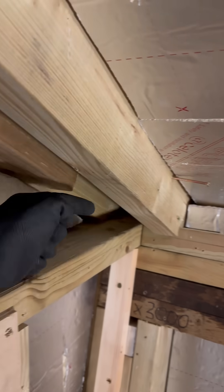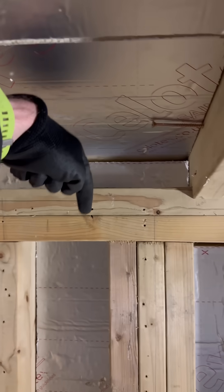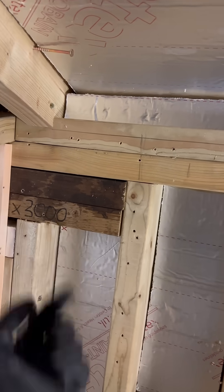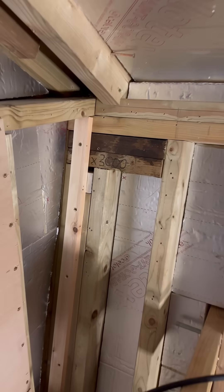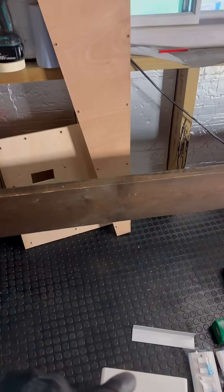So what I'm going to have to do is make a hole just in the rafter, bring the wire through here, bring it through this piece of bracing and then into the fuse box this way. It's a very complicated way of doing it but it has to be neat. We've got the power supply coming in so that needs to be fed up there to the fuse board. I'm just making sure all the routes are clear, then I can put this board back on and reattach the consumer unit and start to wire this up.